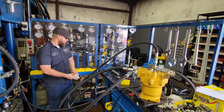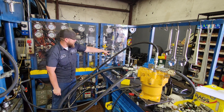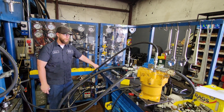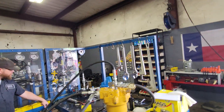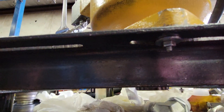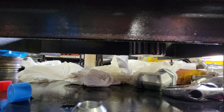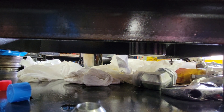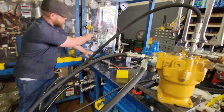There should be no resistance there. When I pull this, the shaft should start spinning, and you're probably not going to see a whole lot of pressure here because there's no resistance on it. So now the shaft is spinning — it's reading no pressure on the gauge. It's hard to get a good angle there. We still have no flow on the case. I'm going to shift it the other direction. No flow on the case, there's no resistance, there's no pressure on the gauge.